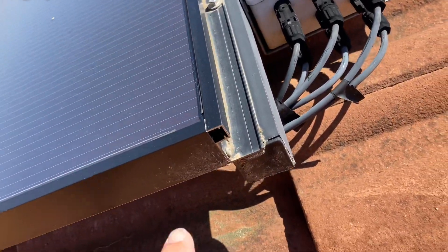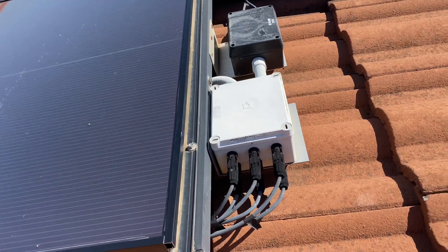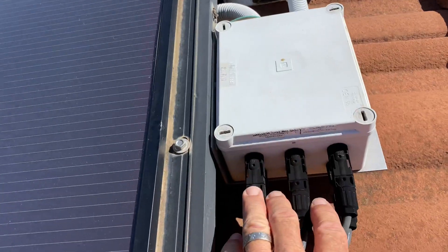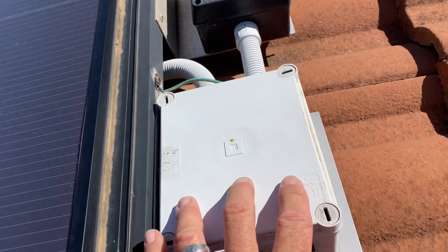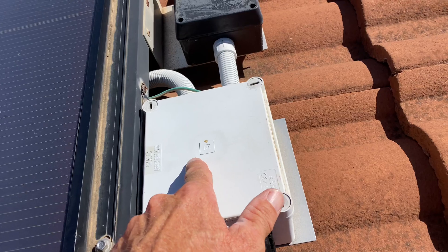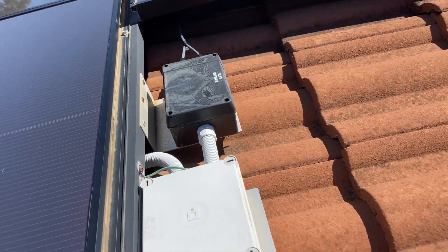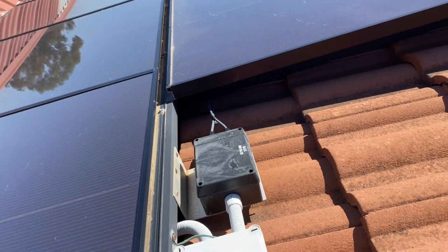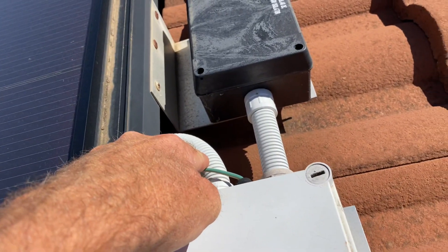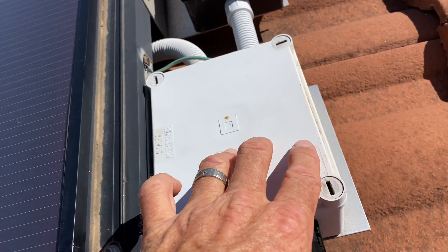They had a fairly unique mounting system as well, which was pretty cool back in the day — would have been pretty labour intensive. The reason I'm out here is under here you've got string fuses: three for the positive and three for the negative, so six there, and four in that one because that's another string. So we've got four strings, and these are what we call a combiner box where they all parallel together and go down to the inverter via that conduit. What's been happening — same reason I was here last time — is three of the fuses had actually blown.